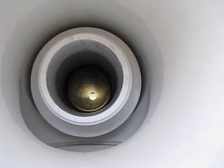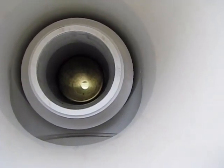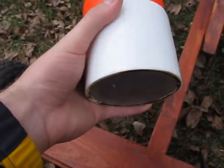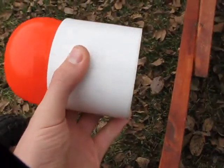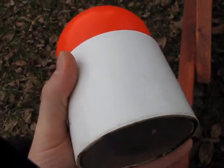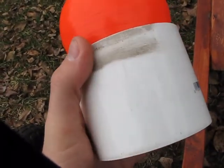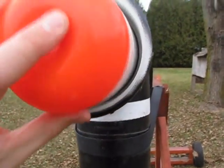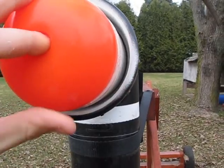The same goes for the piston coming back away from the barrel — you only need about a quarter inch; I have mine set to go back about a half an inch just to be safe. Now the piston itself is a pretty simple design. This is just a 3-inch coupler — not a schedule 40 coupler, just a drain waste vent coupler. I've sanded off the little bumps that stick out on the side, so this thing will go in here and slide fairly freely, but there's also not an incredible amount of wiggle room in there.